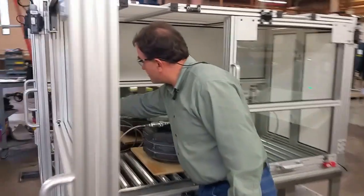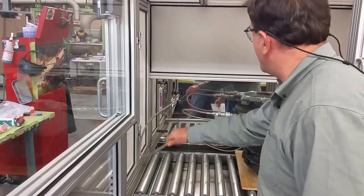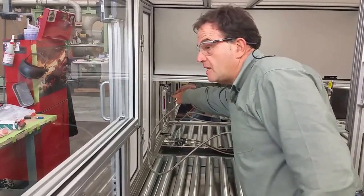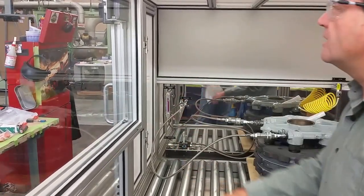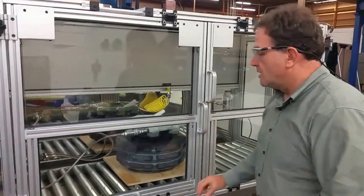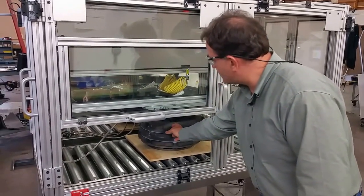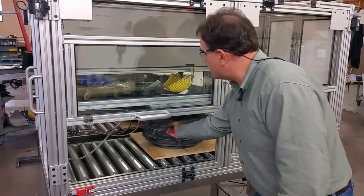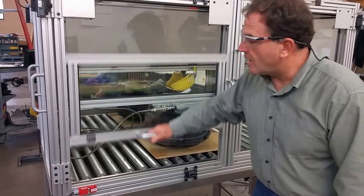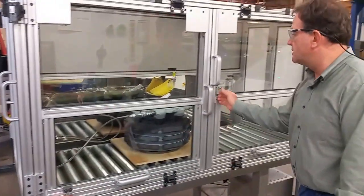There's a pressure supply with a manual shutoff valve and a bleed port and a bleed indicator. See that later. Sliding door to allow access to the wear pin and check for rotation. This is interlocked and cannot be opened above 4,300 psi.